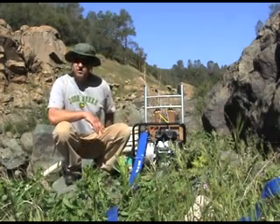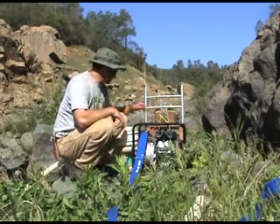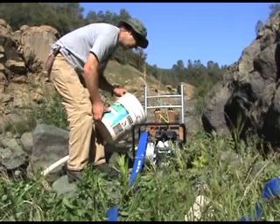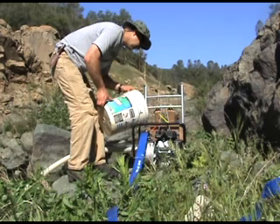I have my 2 inch suction hose in the water right now. Before we start, it's important to remember to prime the pump. Simply take the top cap off and pour a bucket into the top part. It only takes a few minutes.